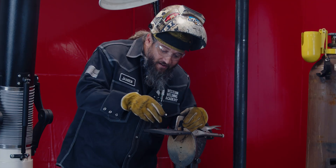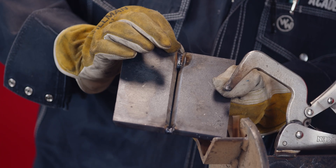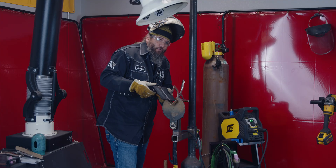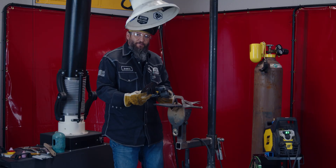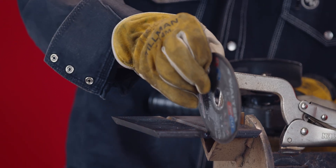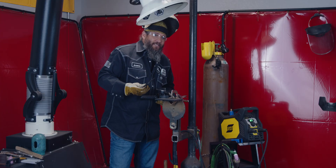I've got a small tack on my startup side and about an inch on my finishing side. I'm going to fire up over here, and if I have a small weak tack on the start side and it's ground thin, it can crush or break. When you get on pipe this is going to be a big deal - you need solid tacks to hold your fit. Now we're going to prep these tacks: I use a cutoff wheel and grind the tack edges very thin. When I fire up I want to burn through that tack, and on the finishing side I want to burn through it as I come up onto it - that ties everything together into one clean solid root.